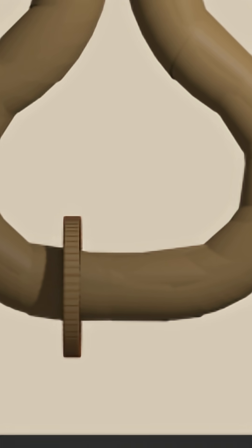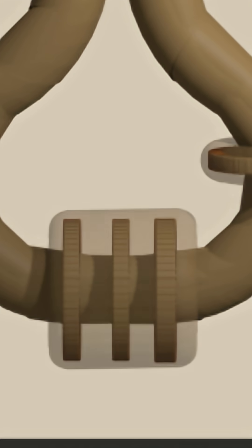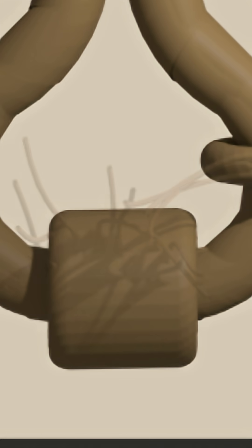The winding is formed by wrapping enameled insulated copper wire over the paper cover of the core. Also, there are multiple such secondary core winding assemblies placed side by side depending on the requirement. All these secondary core winding assemblies are wrapped together with paper, as shown.